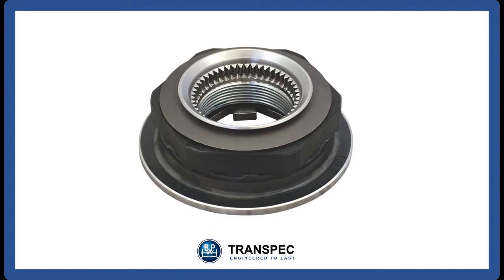This means that no matter how often the axle nut is turned or how many times it clicks, it will get no tighter. At some stage of the life of the vehicle, these self-torquing axle nuts will lose their tension and will no longer be able to apply the required preload to the hub bearings. We therefore recommend that these self-torquing axle nuts be tested every time the vehicle's bearings are replaced.